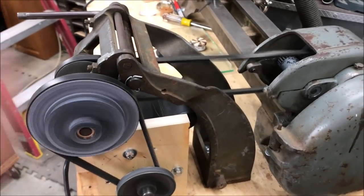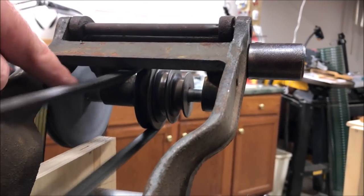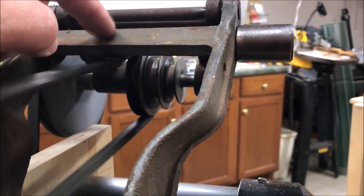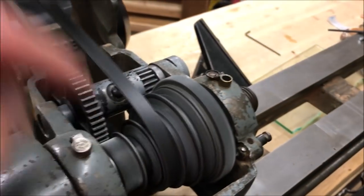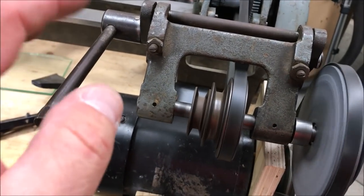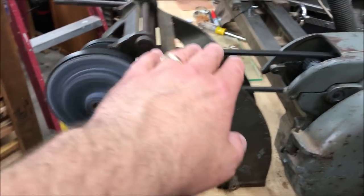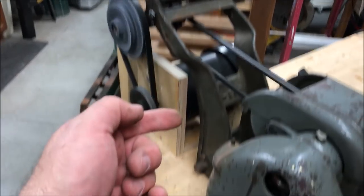See that belt flop in there? You can kind of hear that thumping noise. Up in here, that belt is rubbing against the bottom of this armature, and it's flopping quite a bit. It's supposed to have a little bit of looseness in it so that it can slip if you jam your tool into whatever you're turning too hard — you don't want it to mess your machine up. But I don't know why it's rubbing against the bottom of this. I don't know whether it's because we've already determined that these three pulleys should actually be a set. However, that's got a larger pulley on the outside, and in my mind that's going to cause it to push the belt up and rub even harder. I'm thinking I may need to unbolt this armature and raise it up a little bit so that it's a little bit higher, which would mean a different belt, but I could always move that back to tighten this belt up. I think that may need to be a tad bit higher than the lathe.